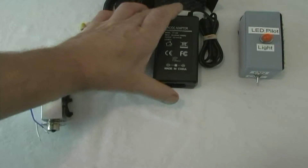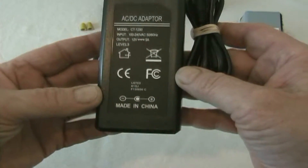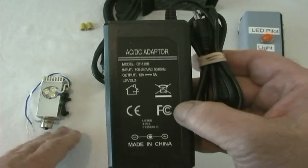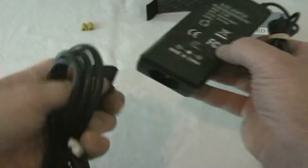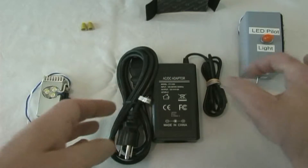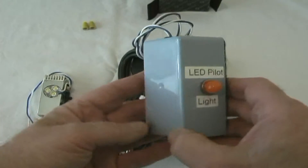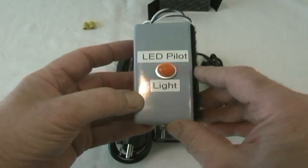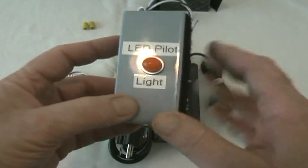The next item is the AC adapter. It converts the AC coming out of your wall to 12 volts, which is what this LED needs to operate. The power cord plugs into it on one end and into the wall outlet on the other. There is also a module which regulates the electricity from the 12-volt supply, producing clean, consistent 12 volts that these new-style LEDs require.